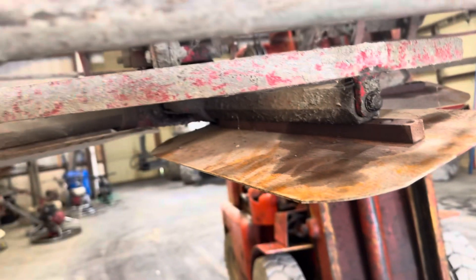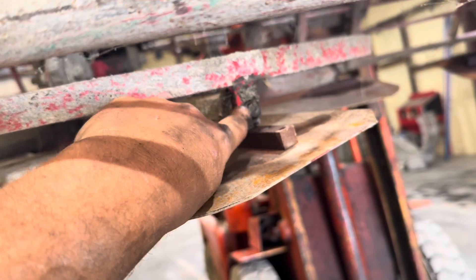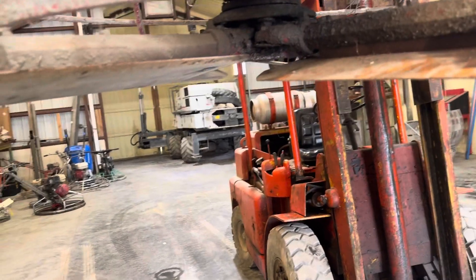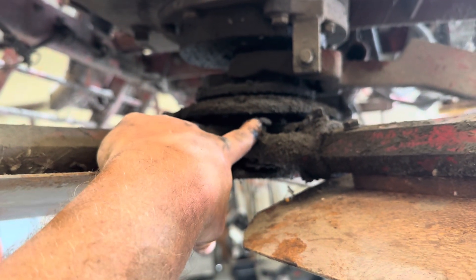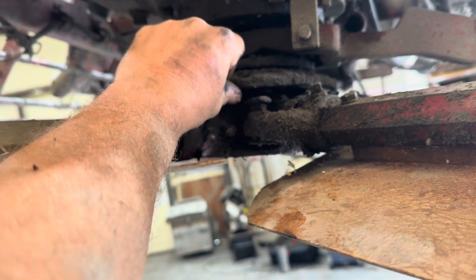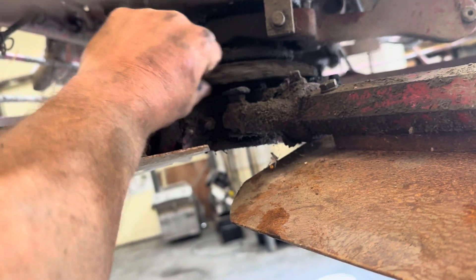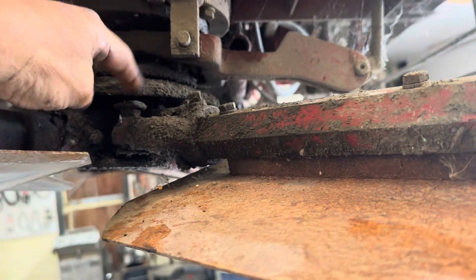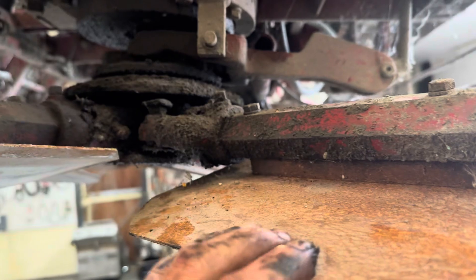You have a stabilizing ring on the outside with an Allen screw that goes in the ends. This just keeps them together — keeps them from flying off, kind of like a brace. I was going around checking all of them, shaking them up and down, making sure they turn because when they turn, that's their pitch. Up in here is your screw for your pitch. This is your thrust band that turns. Whenever you pitch your blades, it pulls this piece up, it pivots, pushes down on this piece, and makes your blades go up and down.